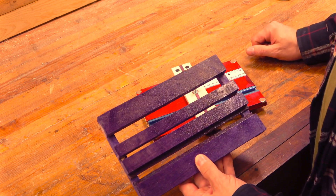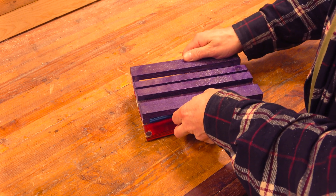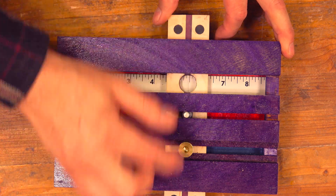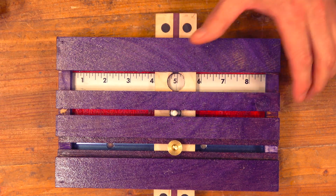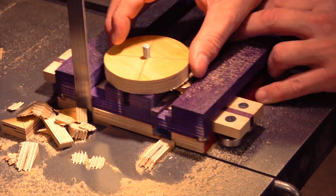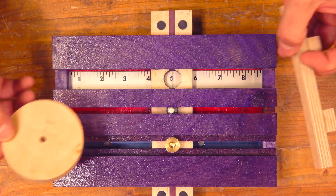In this video we're going to work on the circle jig that attaches to our bandsaw base that we made in the last video. It's held on by magnets as well as a nut. It has a little window here so we can set our size and it works off a pin in the center. Stick around to the end for a more advanced version that I think is much better.